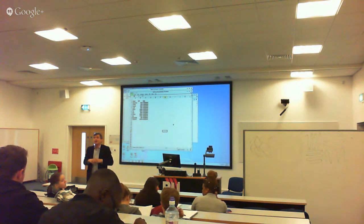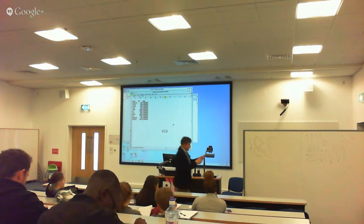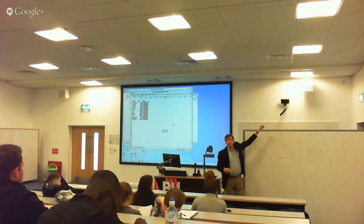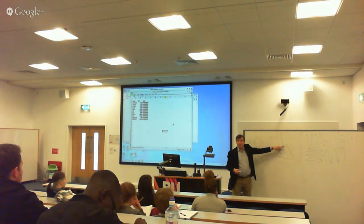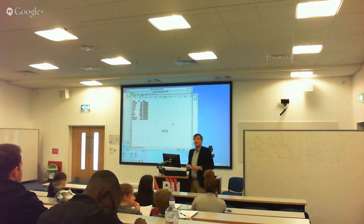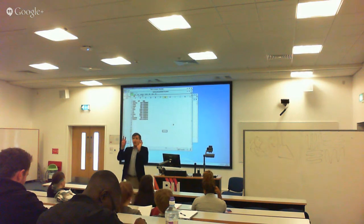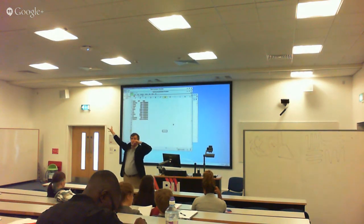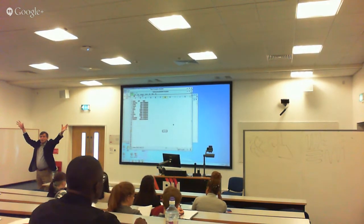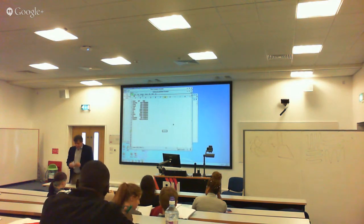What about if you melt a metal? Metals have an exact melting point. What happens with metals? They get to an exact temperature, but does its structure change when it's liquid? Of course, because when they are in solid form, atoms are crystalline. And you remember those BCC, FCC structures. They have their regular shape. When they are liquid, they are all over the place. So they don't have a structure per se. The atoms are sort of floating about. So that is the effect of crystallinity.